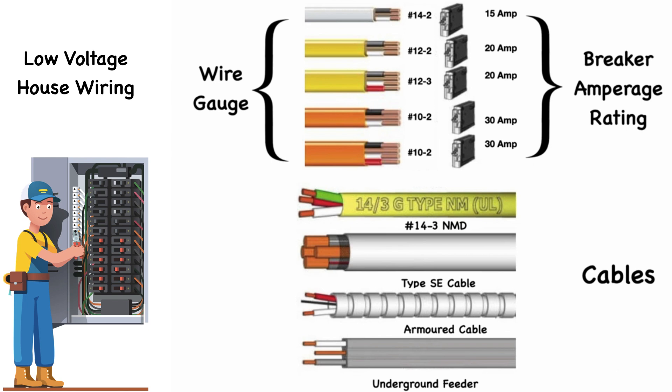When wiring a house, there are many types of wire to choose from — some copper, others aluminum, some rated for outdoors, others indoors. In general, however, there are only a couple of varieties used for wiring a residential home. Romex, shown here in yellow, is the trade name for a type of electrical conductor with non-metallic sheathing that is commonly used as residential branch wiring. In fact, Romex will be the most common cable you'll use in wiring a house.